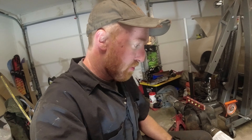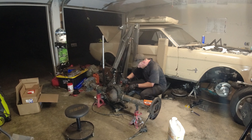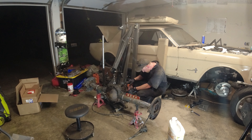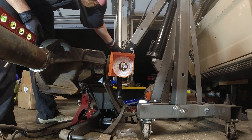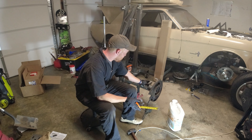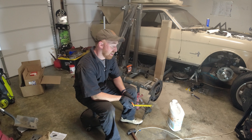I got my line here — it's kind of hard to tell through the camera but it is measuring out exactly where I want it: 4.375 inches, making sure the input is actually perfectly level on here. Now I gotta make sure they're exactly the right width out and also exactly level.